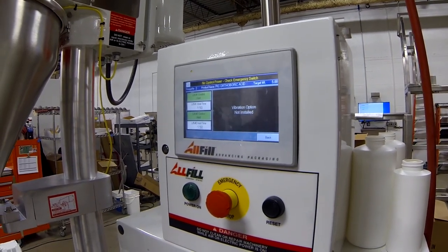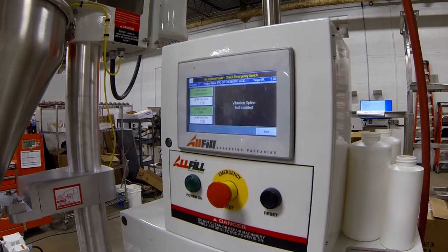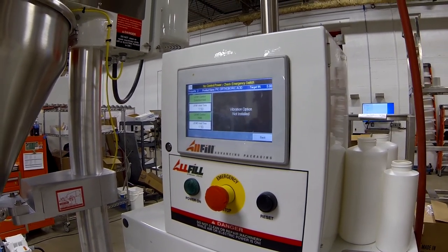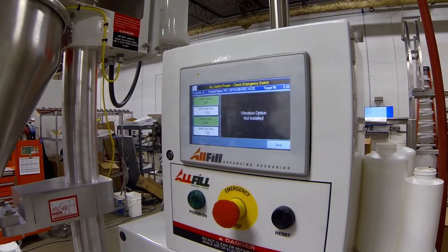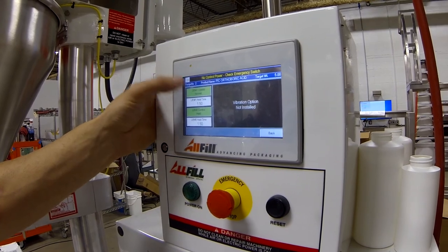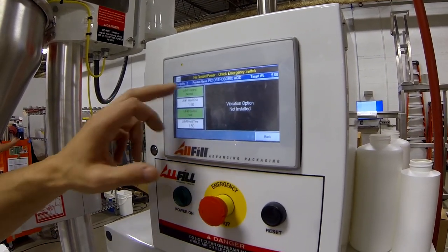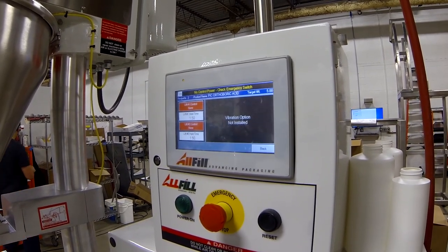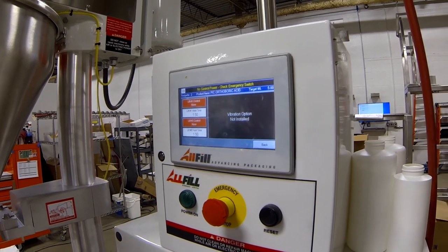Lift and vibration — this is the pneumatic lift. Lift hold: you're going to come up, start your fill, and drop away. Extended hold means you come in, lift to whatever your lift setting is, hold for the full duration of the fill, and once the fill stops we sit the container down and pass it through. Lift hold time works with the hold method: the jar comes in, lifts and holds for 1.5 seconds of the fill cycle, then drops away. Normal lift: go in, start, fill, and just drop away at whatever speed you've got set. My advice is usually no lift — it's faster.